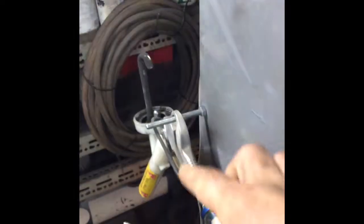Put the powder on here — obviously you've got the gun. Get it all set up, which means hanging the part on one of my racks here, putting the negative clamp onto the wire that's hanging onto the part itself, operating the foot pedal which is down there, turning the machine on at the right time, getting the powder charged up, getting it all stuck to the part. Let's see how we get on.